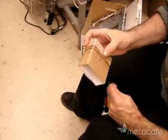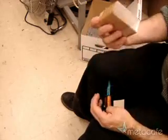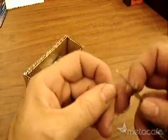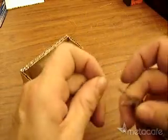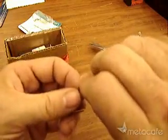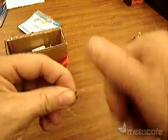Wind lightly — 300 turns will let you turn the magnet very slowly yet still light the bulb; 200 turns if you're lazy. Clean off all the red plastic from about an inch of the end of the wires, then twiddle the wires solidly together with lots of twists.